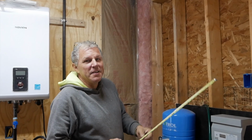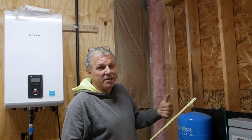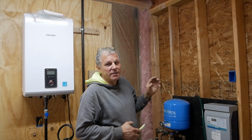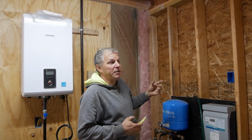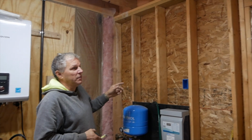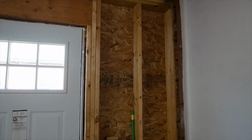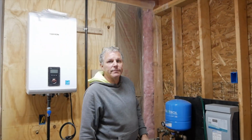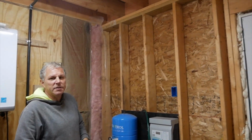Intake for our boiler? Intake for the ERV, right? Okay, so you need 2 intakes. The intakes need to be 10 feet or more from the exhausts. And how wide is this room? What do we got? About 11 feet. So it's 12 by the time we put the walls and everything in? About 11 feet. So we're just outside the 10-foot minimum.